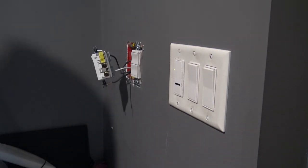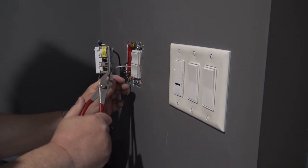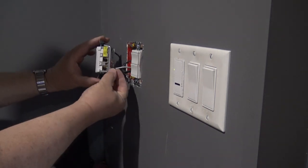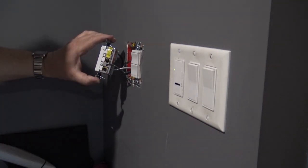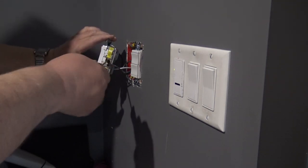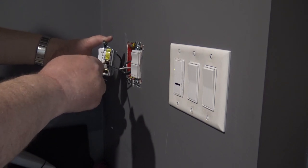This is the most hazardous part - I'm going to have to use my pliers and grab that bare wire and put a twist in it. This is the point where I want to make sure I'm not touching anything grounded, otherwise I'm going to become the conductor. I've got a hook in the wire - I'm just going to hook it around the black screw and carefully place it in. I can get away with touching the metal frame here because I don't have a ground wire hooked up to this yet. If I had hooked up a ground wire, then I could get a nasty shock if I were to touch the hot wire.